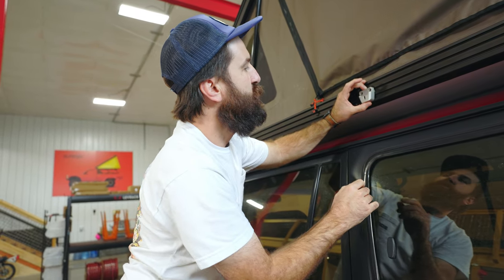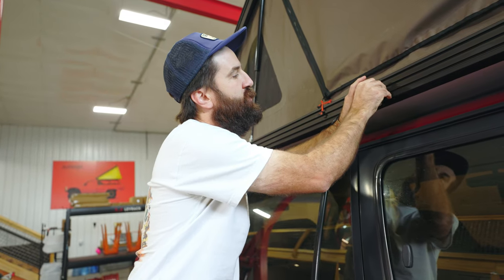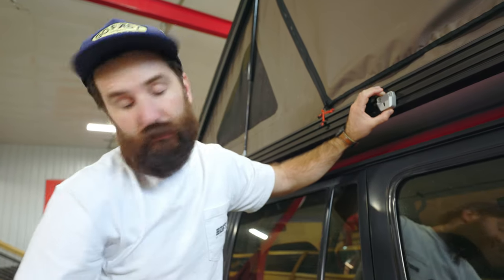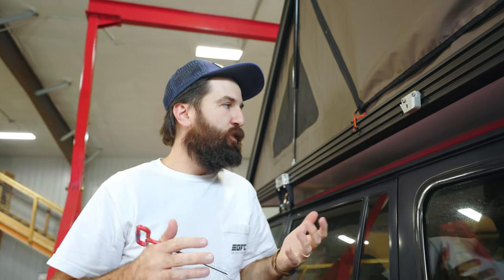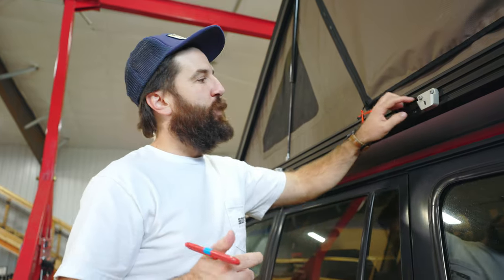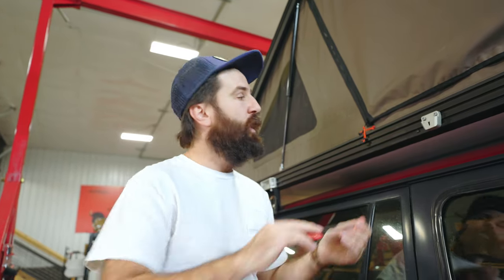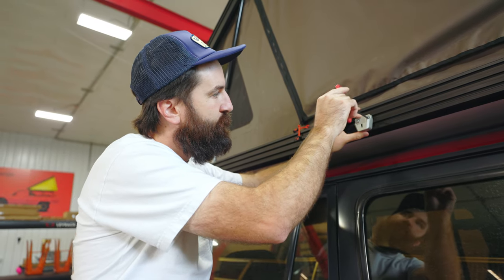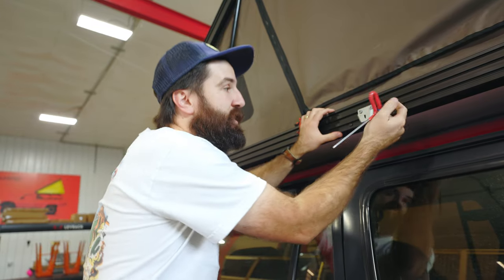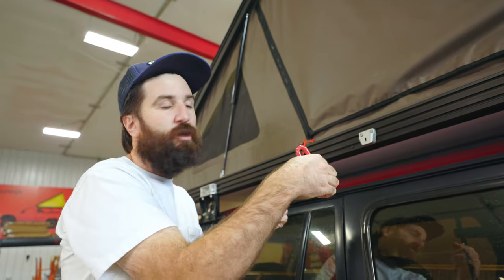I'll kind of just get that up there to look and ensure correct spacing. These fasteners are all aluminized zinc to prevent galvanic corrosion on dissimilar metals interfaces. What that means is the coating is kind of thick, so your normal 5/32-inch Allen key — you might find that it's a tight fit. The reason is the coating, but that coating is also what prevents it from corroding permanently onto your product. Get these snug, making sure that they're still spun 90 degrees — you can actually see that visually from the back side.